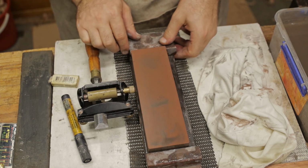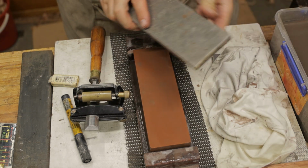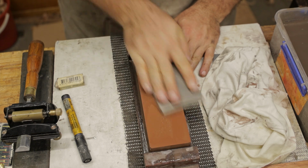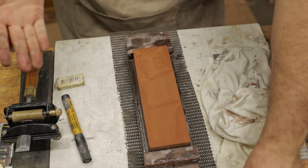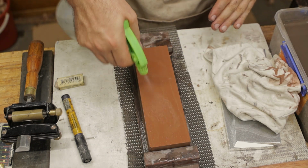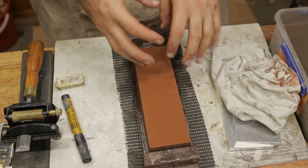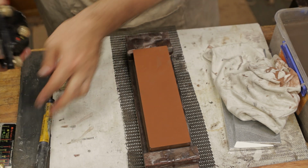So now we're done there, we move on to the last grit, and you can keep going to whatever grit you've got. That's just personal preference, with whatever stones you have and whatever methodologies you subscribe to when it comes to sharpening. And you could skip the strop altogether if you really wanted to. I like the strop process, so instead of going up to say a 12,000 grit water stone, I use a strop. You can do whatever you like with this process, but you follow the exact same process.